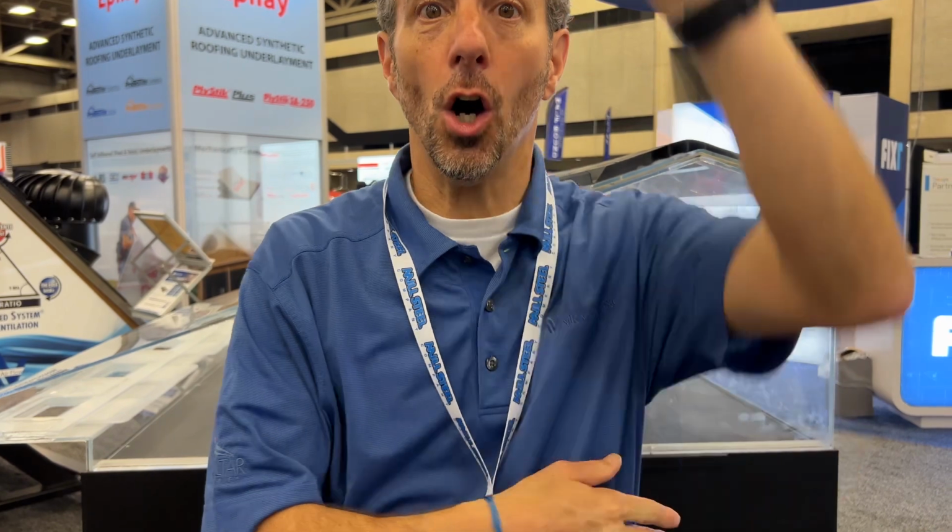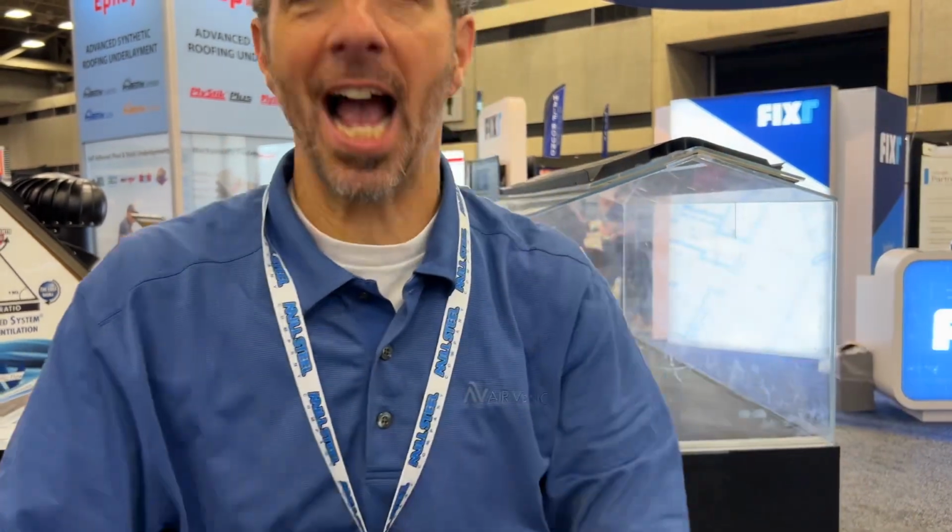Would it work if that was too much work? Would you consider maybe a solar vent in some cases? I see where you're going. Are you thinking because it's lower output? Probably the ridge length is too narrow. Too narrow for ridge vents. Yes. Would you then consider a solar power vent? A solar power fan or a traditional electric power fan? Correct. That way you're not using the highest peaks of the roof. Exactly. And the power fan, if you give it a good intake, should be strong enough to pull the air for the attic. You can size the fan for that attic's needs.